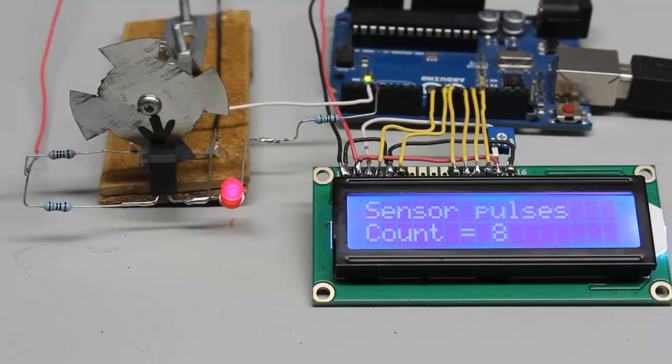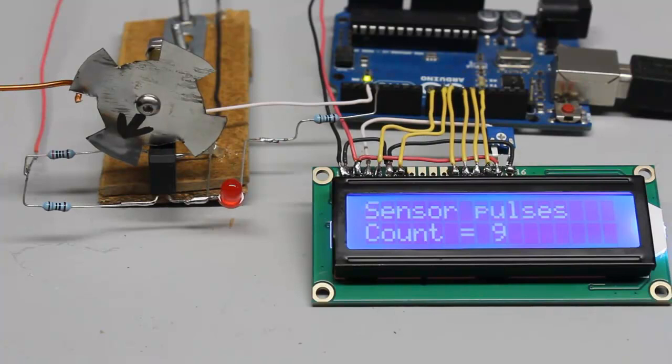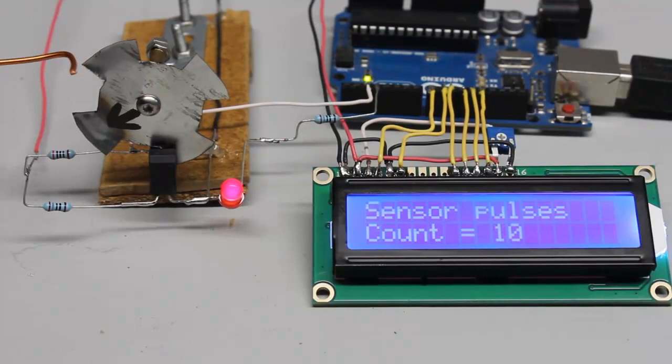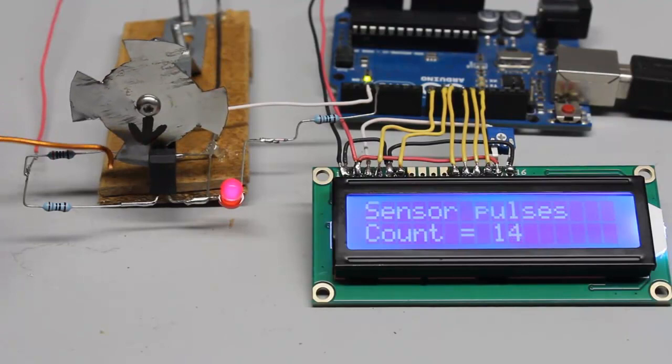Between a high-to-low and a low-to-high transition, the disk has been turned by 45 degrees. The disk has been turned by another 45 degrees if the signal falls back to low. The signal also changes from low to high or high to low when turning the disk counterclockwise.